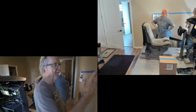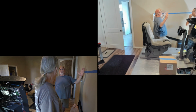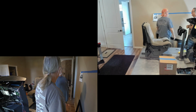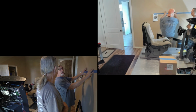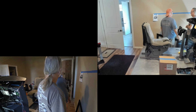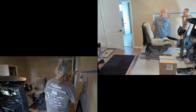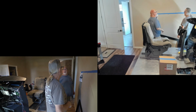On that one, we went into the studs on that side, right? Yeah, but because I moved it, I had to put a 2x10 on there because it shifted down that way. On that side, when we originally set it, it went right into the studs. The 10 was big enough that the bracket had enough room. And if you wanted, even a 2x12, because remember when we were trying to measure the center. You could buy a 2x12. You just gotta get the right length. I think I got 3 foot. Then I hit the studs, and we countersunk it so that you can move that bracket either way you want. When we get ready to do that, we'll talk about that.